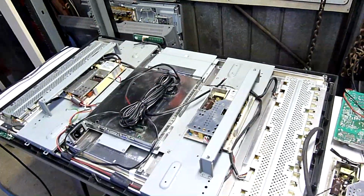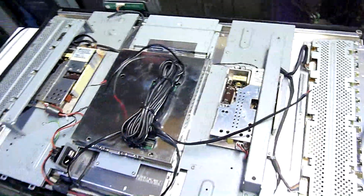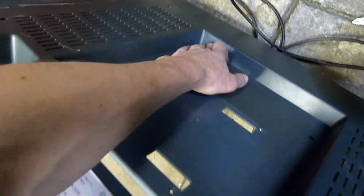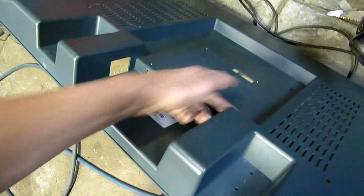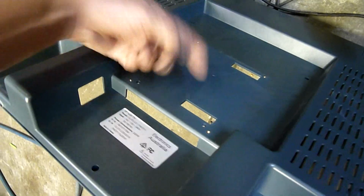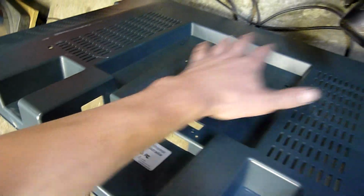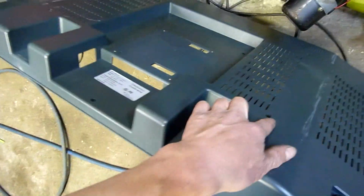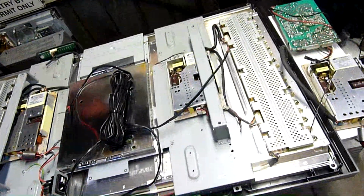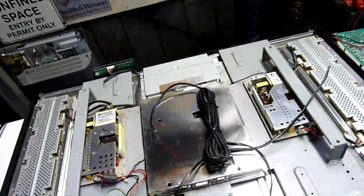Oh well, let's make some connections, run some cable, put some cable glands in the back cover. We'll cut in up here. Control, 12 volt out, cables can just run down here. I'll cable tie the converter module in here, just tie that on there and run the D-sub cable. Everything will be tucked into the back cavity here and then attached to a wall mount bracket, which I still have to get. A wall mount bracket's about $30–40, so I'll go to Bunnings and get one of them when the time comes. It's got decent mounting points, that'll do.